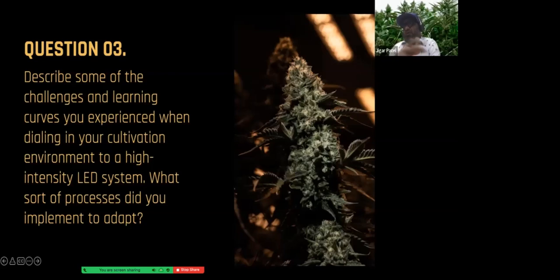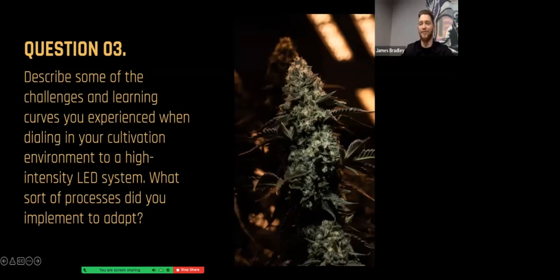And a crazy story is we've been designing a new build, and it took us like 2 months of trying to convince engineers that we were really putting this much water up in the air, because nobody believed us. And that's what we see a lot when transitioning over. You're going to need more dehumidification, but just how much you'll need depends on how hard you're pushing those plants as well. You guys have been able to achieve those high yields, and obviously the plants are going to be transpiring like crazy when you're really dialing in that system.